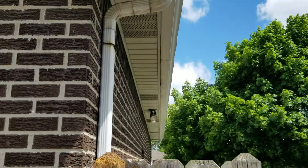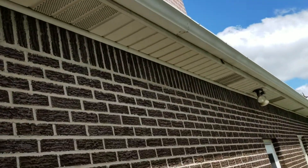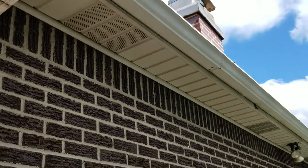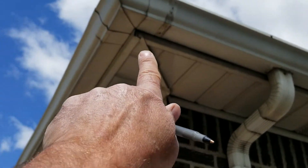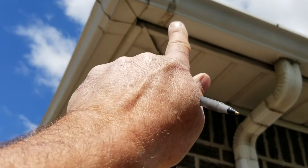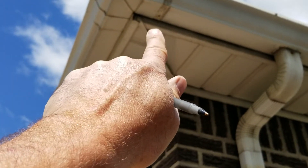You can see how the spikes and everything's all pulling out across the top and they got seams all over. We can get rid of these seams and go with a seamless system. What we do is cut our corners at a 45-degree angle and use strip miters on these corners, so the water doesn't have to go down into a box miter and climb back up.